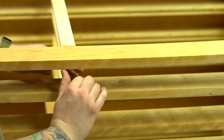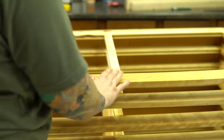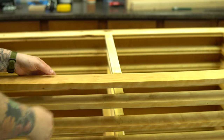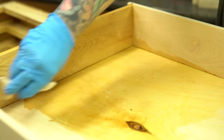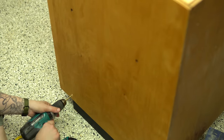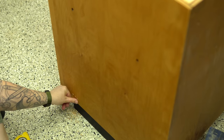I can't attach the wheels until those little painted inserts are dry. So I'm going to focus on the top. This top rail here is a little bit bowed, and because underneath there's a drawer that slides all the way through, I can't put anything in there to space it properly. My hope is once I put the top on, I'll be able to screw up through that board into the top and it will pull it straight. I'm opting to use a little bit of wipe-on poly inside the drawers — I know it says wipe-on and I'm using a brush, but this is the utility cabinet. I'm drilling the top three holes first, then attaching the wheels to the cabinet, sliding the insert underneath the bottom, drilling holes, and attaching there.